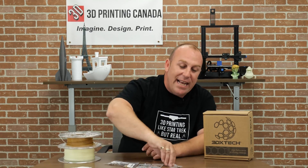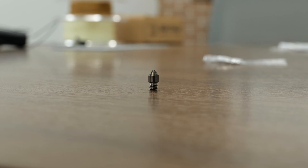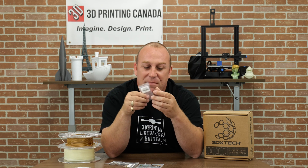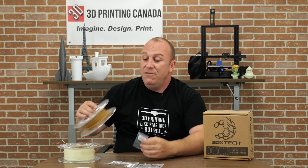Next, my favorite — hardened steel. For around $7.95 to $8.95 Canadian, hardened steel is what I use for everything. It's not going to be as thermally conductive as brass, but still maybe only five degrees more max with a hardened steel nozzle depending on your speeds. I print TPU on these, I print wood filaments — like this awesome Spectrum wood filament — it prints really wonderfully.